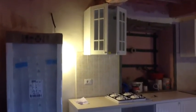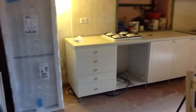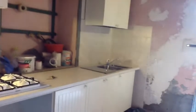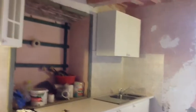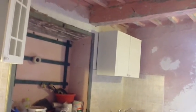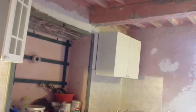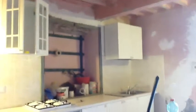You can see a cover up there — I need to drop it as the doors won't close. I just need to connect the oven and the gas. There's the fridge, the oven is just here. I need to connect the taps and the drain to the sink, which shouldn't take too long. I've also got to lower that cover as the plaster behind it isn't holding strongly, so I'll inject some quick cement.